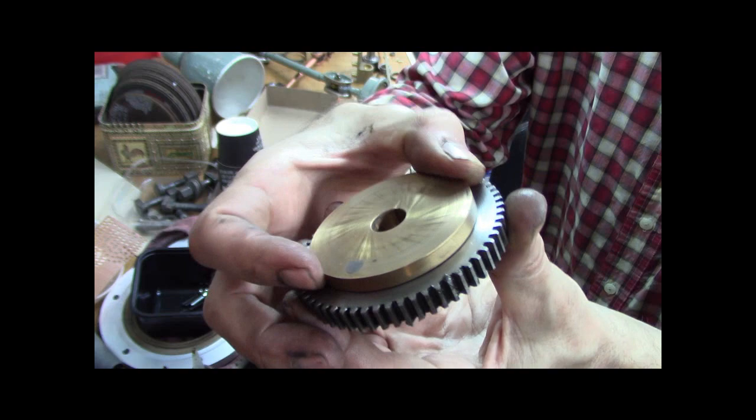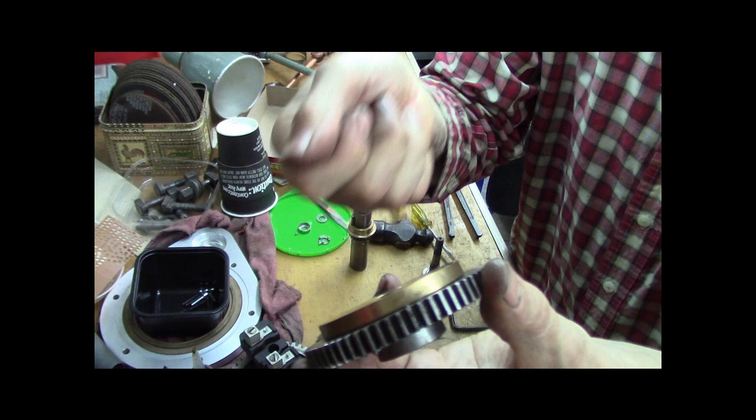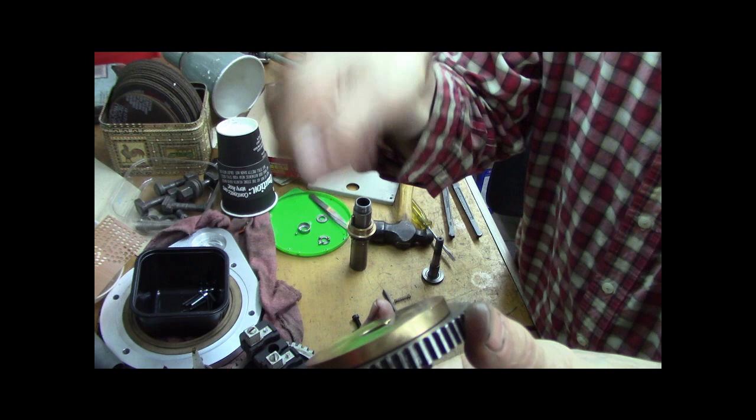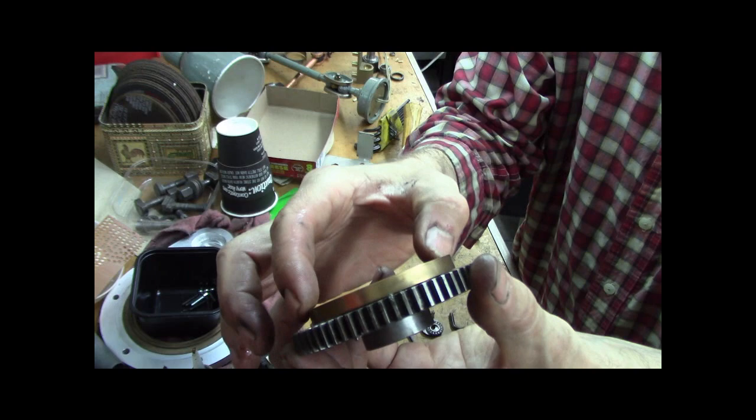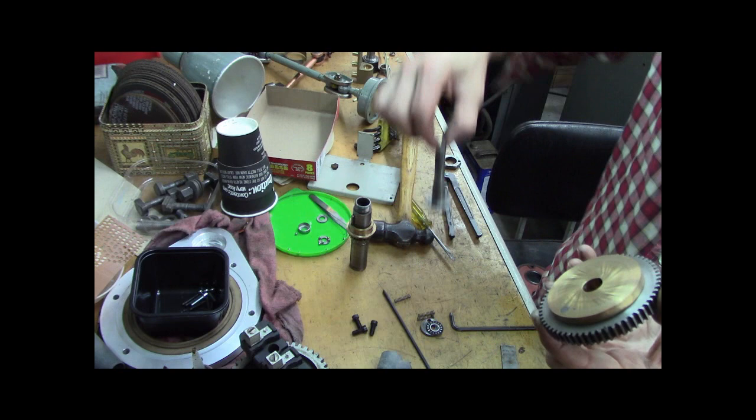Well, I figured this out. When you tighten this brake, it's so you can back off one turn when you're threading to retract the tool, and then go back in and set the tool and infeed with your compound. So this is just an in-out retraction mechanism. It's a placeholder mechanism, right? So that's cool.